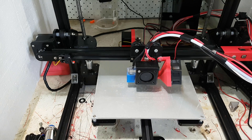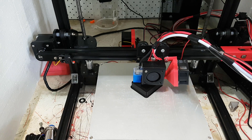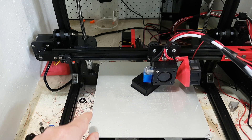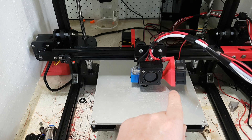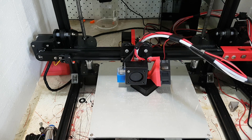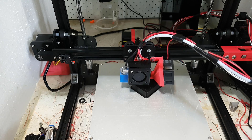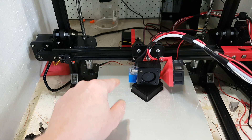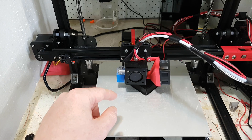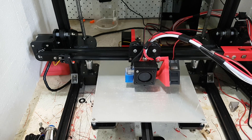I wasn't really a fan of the glass because of the way auto-leveling works. If you don't have an auto-leveler that's fine, but the auto-leveler measures the aluminum plate below the glass. If that aluminum plate has a convex or concave shape, that will differ from the glass surface - and in theory the glass itself could also bow with continual heating and cooling. So I didn't like the idea of putting glass on there because the auto-leveler ignores the glass and works on the aluminum below it. You can get touch sensors but they don't work with the TronXY default board.